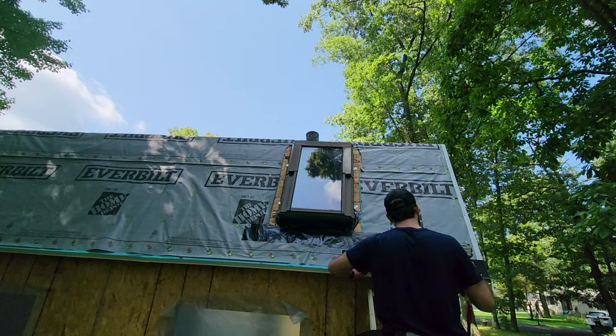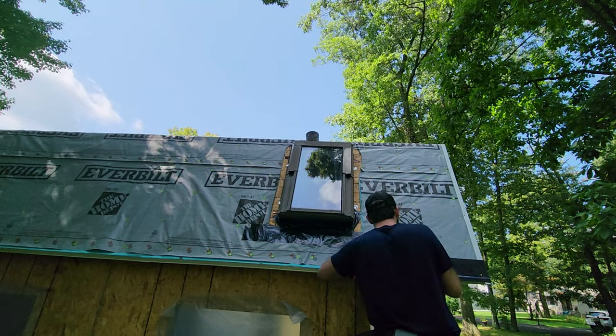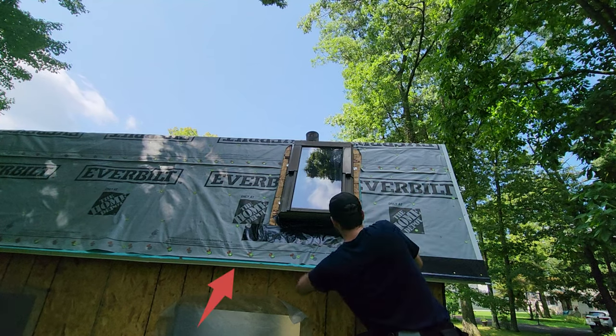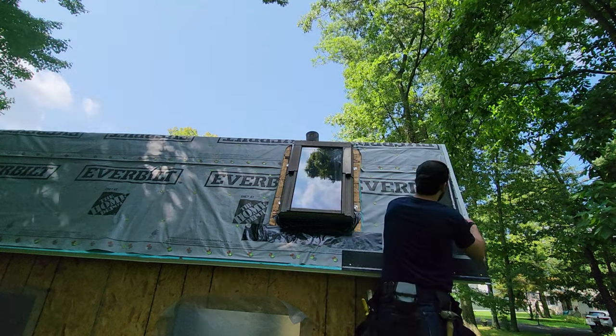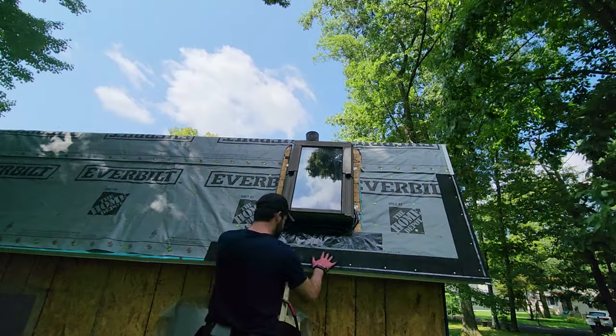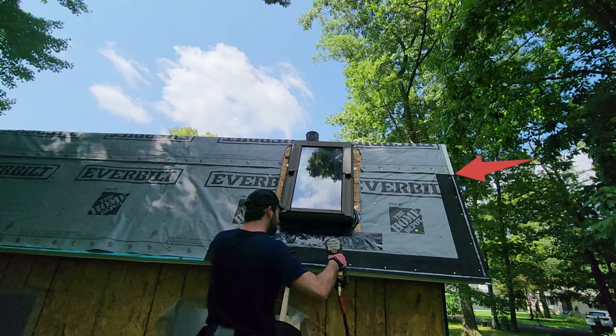As with most roofing components, for water to shed properly, you want to start with the bottommost starter strips first, those along the eave edge, and then overlap the eave starter strip with the rake end starter strip. You don't have to overlap the starter strips up the rake ends though. You can simply butt joint them.